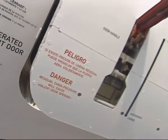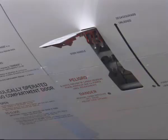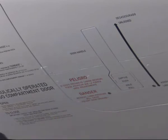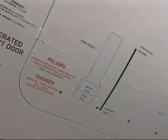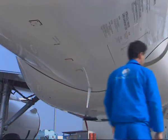When the door is in its frame, release the control selector. The yellow electric pump remains operative during a time delay. Lock the door before it is able to open again due to internal leakage and the door weight. Pull the door handle down to its locked position. Push it into the recess of the door structure and check that the locking indicators are green and the door is flush with its door frame. Check that the vent door is closed. The spring-loaded flap locks the control handle. Check that access panels are closed and the door is closed.